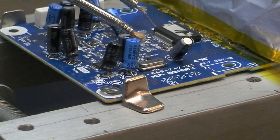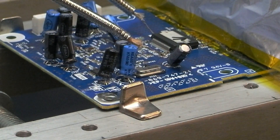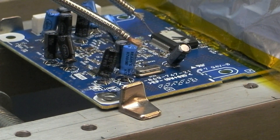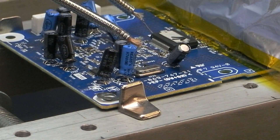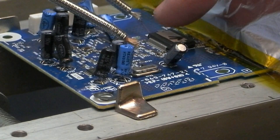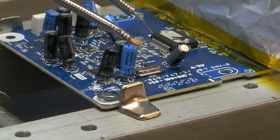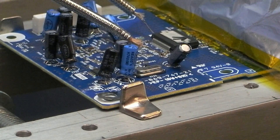We've got a digital amplifier chip here that needs removing. There is a dead short on one of the supplies — I've ruled out other components on this board, so it can only be the amp chip. What I'm going to try and do is use the preheater to get it up to 130 then 150, then try and use chip quick on the pins and see if we can just lift it straight off without using any hot air. There is a substantial heatsink plate on the top here; I don't think it's bonded to a ground plane underneath, but we'll try and get the chip quick up to temperature and lift it off that way. If not, we might have to go for the hot air.